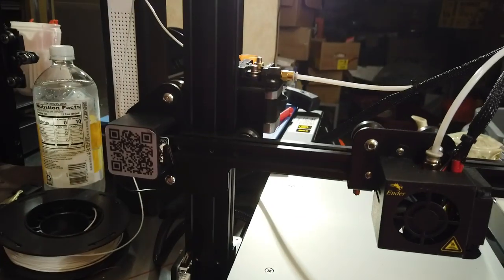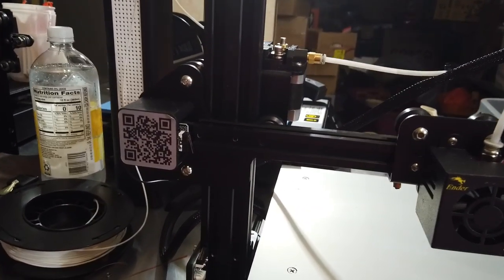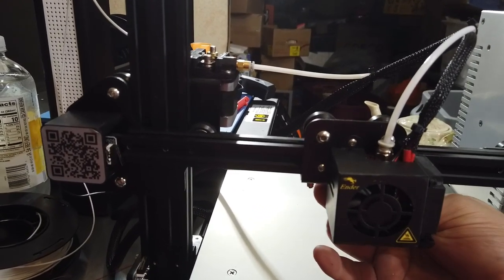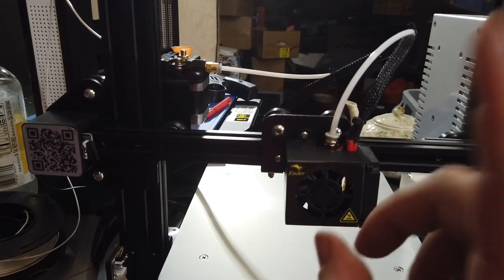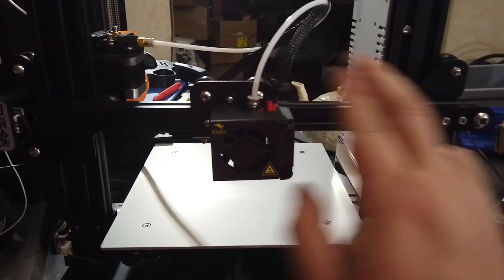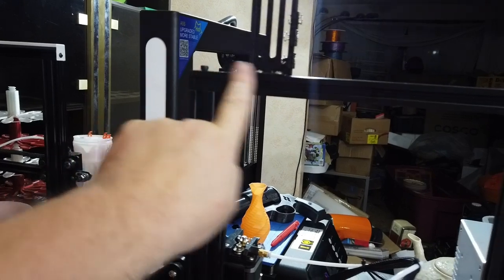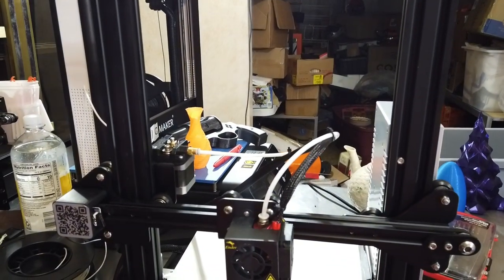So now this no longer moves — I can push on it and it does not budge, which is what you want. Now I'm going to double check and make sure all these wheels aren't too tight. Basically you should be able to grab the eccentric and force it to spin in place. If you can't spin it in place it's probably too tight. If in doubt, loosen the eccentric until it wobbles, then retighten it until the wobble stops. Before adjusting the wheels I'm going to put the top brace back on so it's the correct distance apart. I'm happy to see QC improving — I was able to thread two opposing screws in finger tight all the way without having to move the towers. Good to see the QC is being maintained.